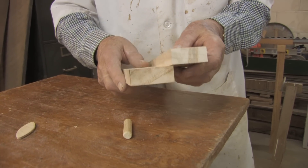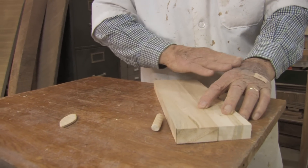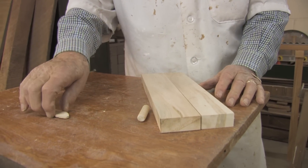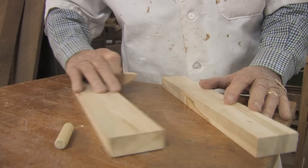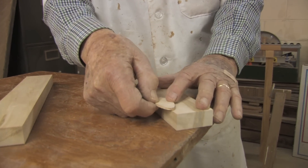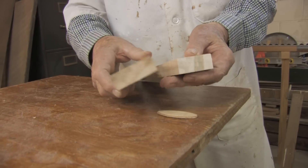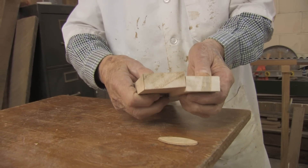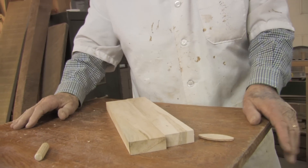That makes the boards register in this position so that you have a completely flat surface. You can also use biscuits like this — the plate joiner carves a hole in the edge of the wood and a matching hole in the other piece, so that when you put them together they register in a perfectly flat plane, giving you a completely flat surface that you just need a little sanding on so that the joints don't even show.